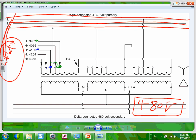And on these, who's going to be doing it on the transmission lines? Nobody's going to be doing it. What they do on the transmission line, they're smart enough to have an auto device that tracks the voltage, and there's a motor that adjusts the connection on the transformers as the voltage goes up and down. We rarely, if ever, do that one on the building side. On the transmission and distribution side, utility type, they use it all the time. Auto voltage tap changer. We're not going to go into that one.